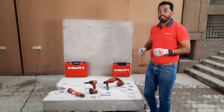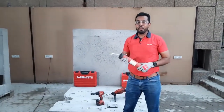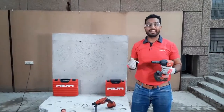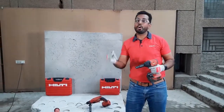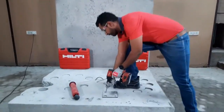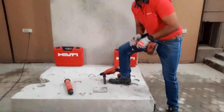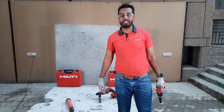The next step is: whenever you drill a hole to fix an anchor, you have to clean the hole with the help of a blowout pump. But in the case of HUS-3, it's not mandatory. What you can do is directly drive the HUS-3 anchor with the help of an SIW impact wrench. The anchor I am using today is an M10 HUS-3 anchor, which gives more performance compared to any stud or sleeve anchor of the same diameter. And that's it — we are done. You see how fast it is to use HUS-3 to fix the temporary structure.